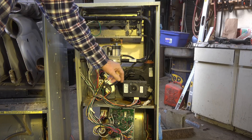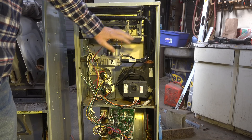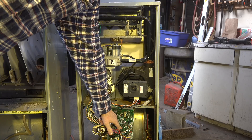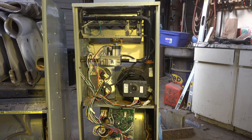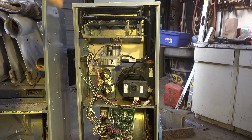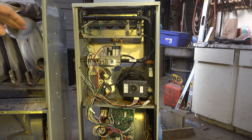We'll use an inducer, the gas valve — all this stuff is going to be used. We're also going to use this flame safety control down here. The reason that's done is so I can have flame safety control. This thing will work automatically and it will be safe. If the flame doesn't come on, it will shut down — all the safeties are pretty much intact.